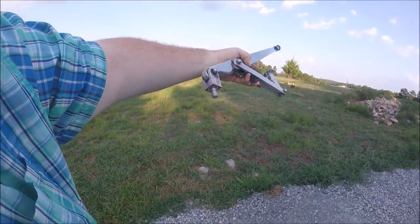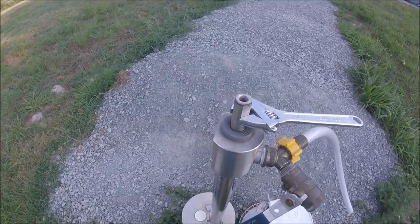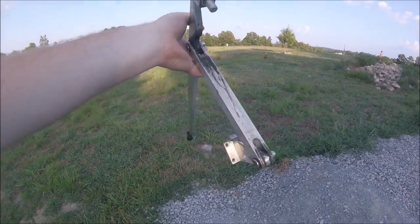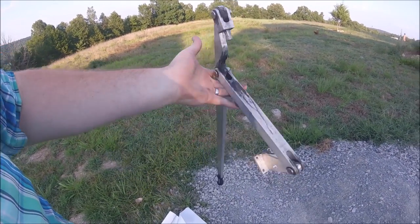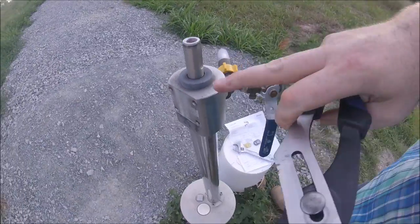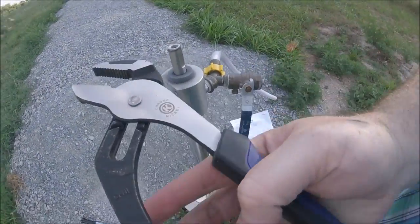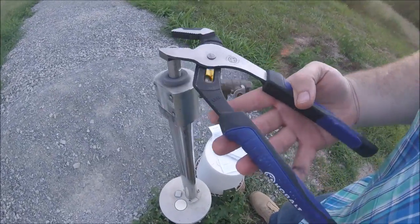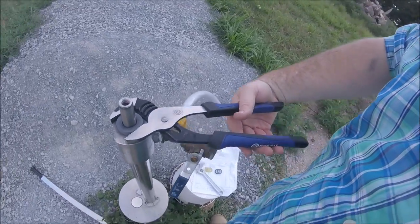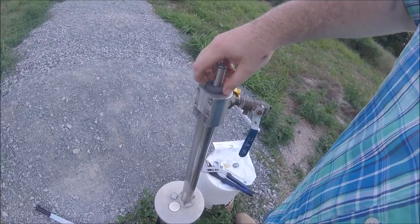You can see this is the pump handle with a lever action, and there's the threading that goes into the main rod, or piston. I'm going to clean this up really good with some vinegar and paper towels and put those new brass washers on there. But let's see if we can get in here and change these seals out. You'll notice this fitting has no edges or anywhere to grip, but in the video I watched with a Simple Pump employee, they were just using a pair of large channel locks — and it comes right undone. That's why they use channel locks.